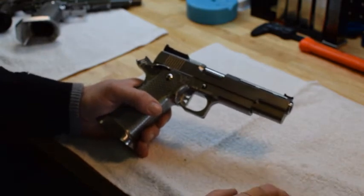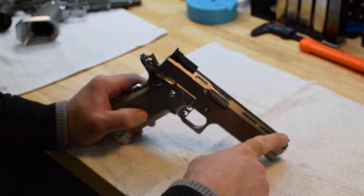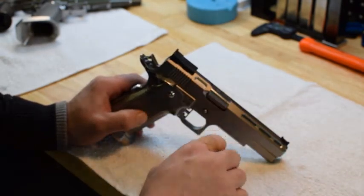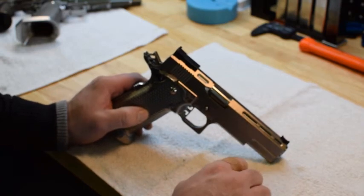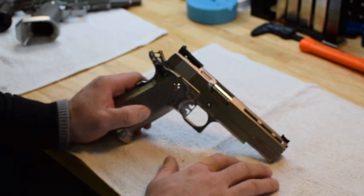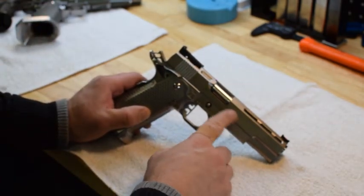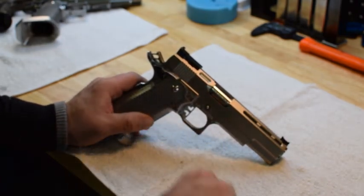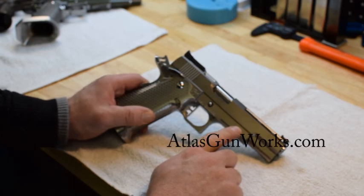If you have a gun and you've had all the work done to it — say you bought an STI Edge and you want to lighten the slide or whatever — buy a blue one first, then do the slide cuts and everything the way you want, and then get a good finish on it. If you buy a hard chrome one, it's a little bit harder to do modifications — still possible, but more expensive. So once you have a gun the way you want it, if the gun is super tight I would do PVD. If it's not super tight and you plate it and send it to somebody who knows what they're doing, it'll come back super tight — they can actually put a little material back in there and tighten the guns up so they run just right. If you send your gun to Robar, they'll do the whole thing for you A to Z. It's a little more expensive, but it works well.